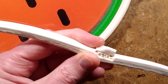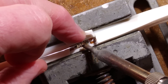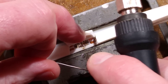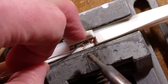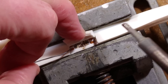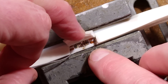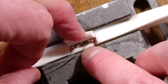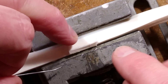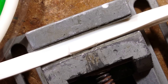This is not being made easy by the fact that the LED tape slides backwards and forwards, which makes it very easy to do the initial soldering because you can theoretically slide the LED tape out, solder the wires on to the end, then slide it back in again. Have I got a bridge? I'll give it a second to cool down. The moral of the story: only heat one soldering connection at a time — if you heat both at once the tape will part. We do still have the option of jumping between these copper pads.